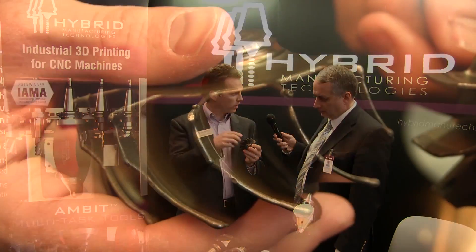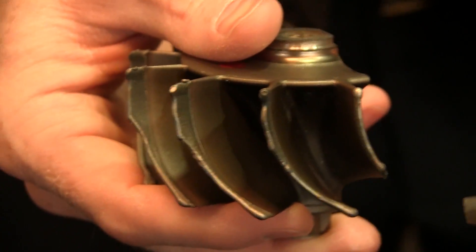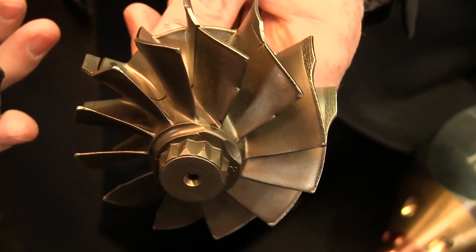I hold in my hand here — this is an impeller out of a Cummins diesel engine. These tips spin very, very quickly and wear out. It's made in Inconel — not a cheap material — so in this case we were able to repair these. This is as it was deposited, and then in the same machine you can go back and finish the profile so that you get a complete remanufactured part.